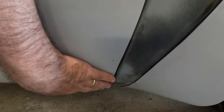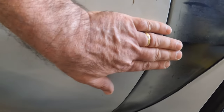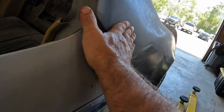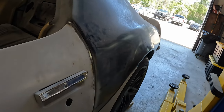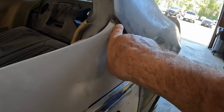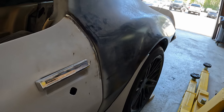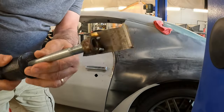The back of the door: my gap at the bottom and spacing at the bottom on the face is perfect — I'm perfect here, I'm perfect here — but as I go up from about right here, the entire door panel itself sinks in. This is a factory door panel, but this is not a factory quarter panel. I don't think the quarter panel is the problem — I think this was just bad door panel gaps from the factory back in '71; they just didn't care. So I've got option one: try to pull this out with a slide hammer and a hook. Let's see if I can pull the entire face of this door panel out.